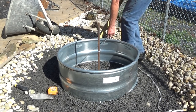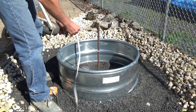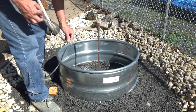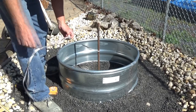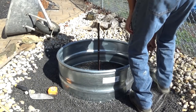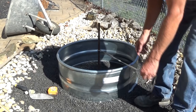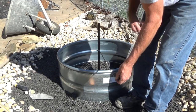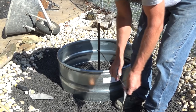This thing right here is out of round. So when we do our layout, we're going to put another knot here, and that knot is going to determine where we place our stone away from the metal. If we stay an inch away like that, the metal will have room to expand. Then we're going to come over here and make our wall 13 inches — we'll put another knot there, and that will be where our wall is.